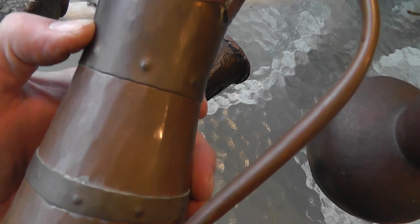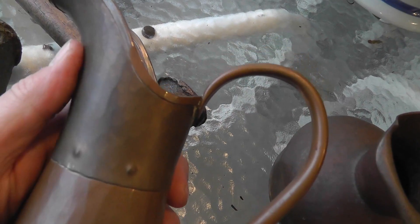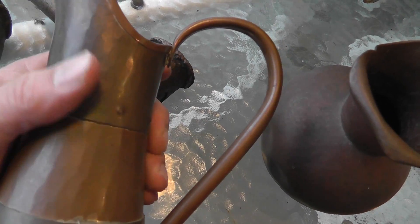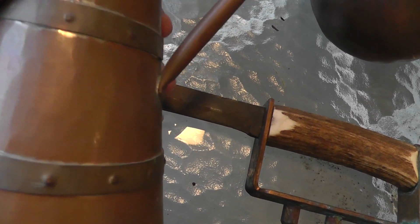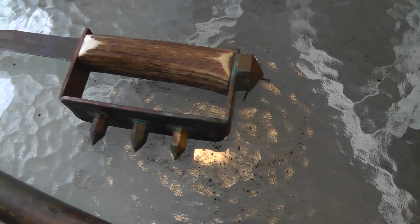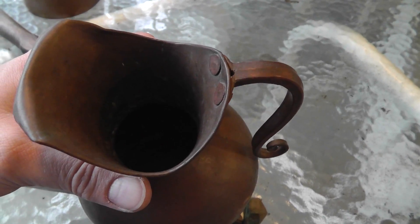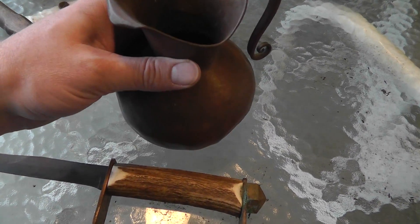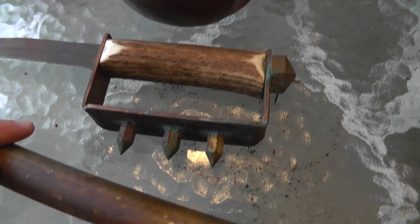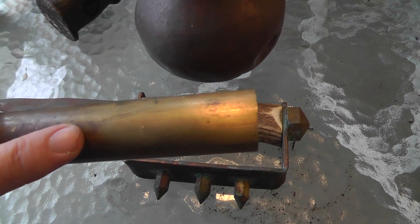This piece is nice — it shows the copper and brass. I've got the brass up here and you can see that little bit of yellow come through. If I was to shine that up, it would be bright, muted yellow. And the copper is this nice, rich brown color. So that's really the best way to tell — basically, you go by color. Both of them are non-magnetic, so you really can't tell that way. And brass is very close to being copper because it contains right around two-thirds to three-quarters copper in it. But best thing to do — look for the color.